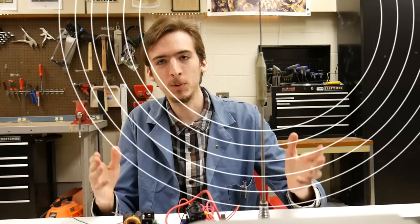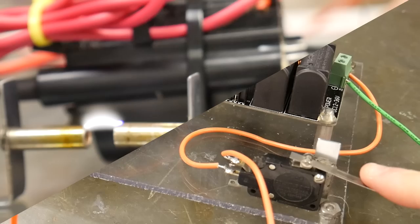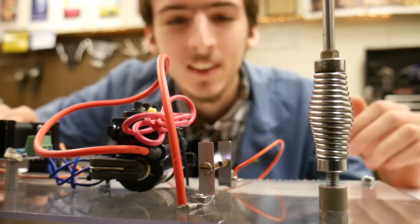The basics of what's happening here is this: when you depress the switch, it creates a high-voltage burst of electricity across the spark gap. And by adding an antenna to one side of the spark gap, it generates radio frequencies which can be transmitted over them thar hills. The sweet smell of radio frequencies, just like Marconi used to make. Hey, Dayton, buddy — you're breathing in ozone. That's not too safe.